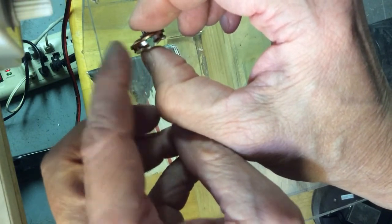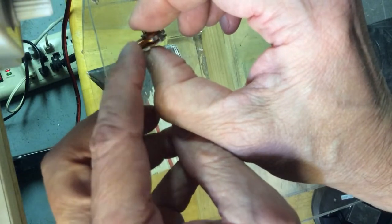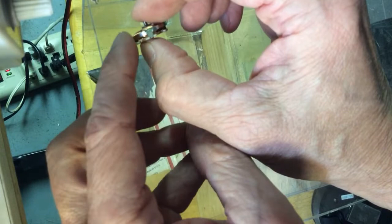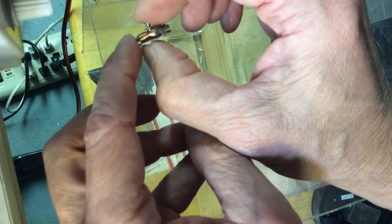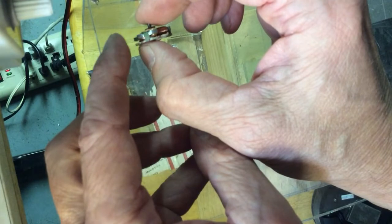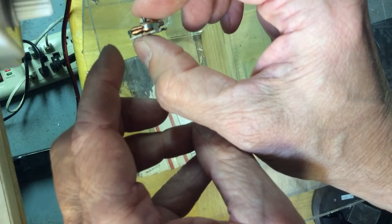You can see I've cleaned off all the OD laminations, so there's no unpolished area — that's all you want to do. I just took like two thousandths off of this, probably. This one was pretty good. I've seen a couple other ones where you take a little more time, but it doesn't take much. Anyway, that's it for the armature OD.